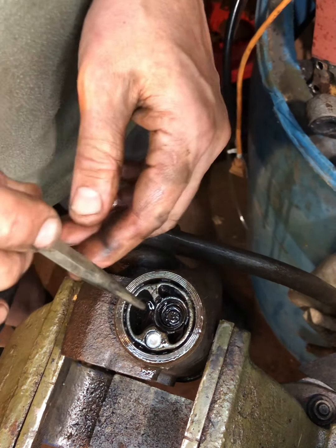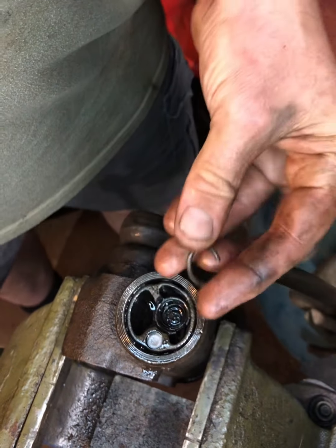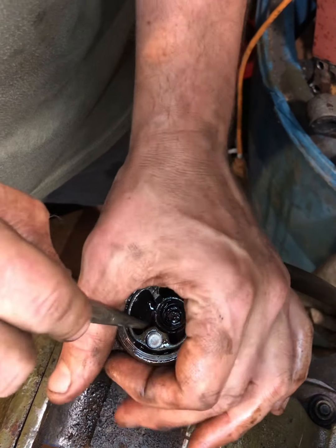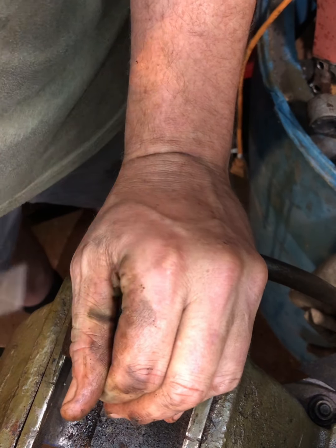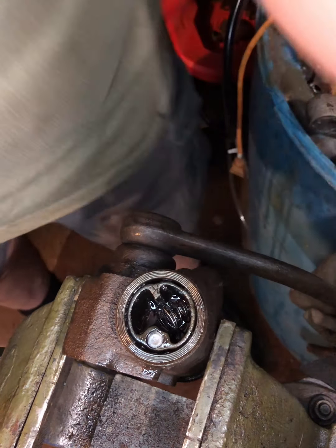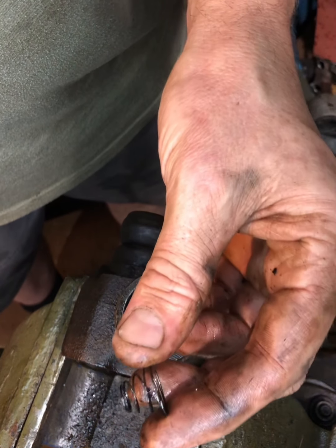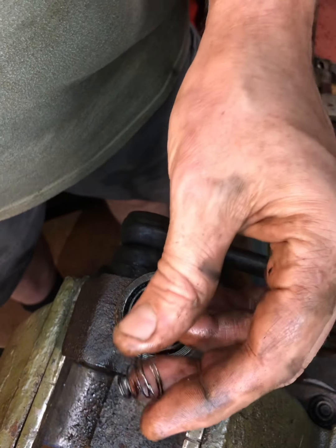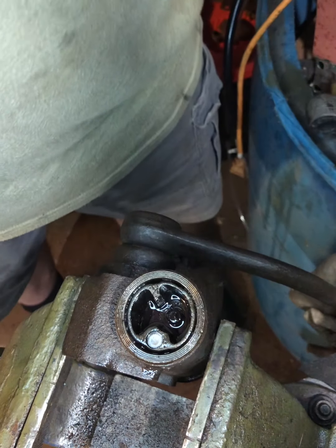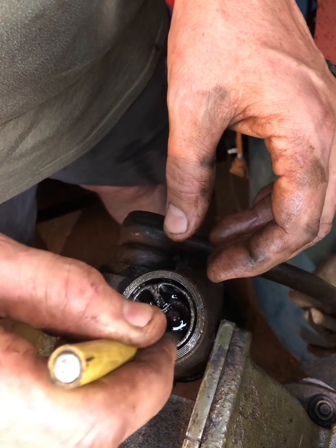The first thing I'm going to do is take this C retainer ring out. There's a little C retainer ring here that holds the spring and everything in place - I'm going to pop that out. I'll pull the spring out. On the compression side there's a spring underneath that's kind of tornado-shaped - the small part of the spring presses on the valve. Right down here is the valve. Actually I was wrong - checking the filler plug position, this is actually the return side.